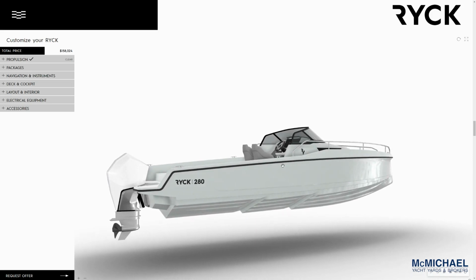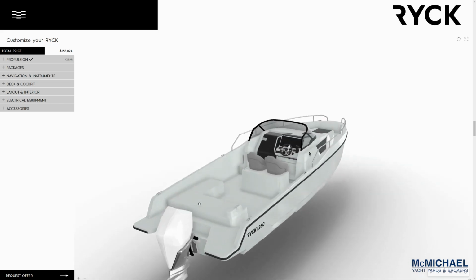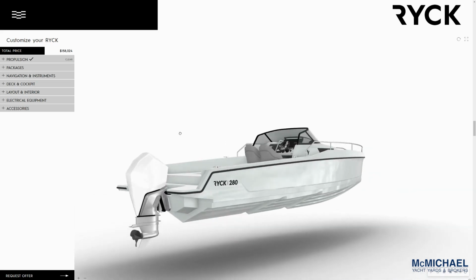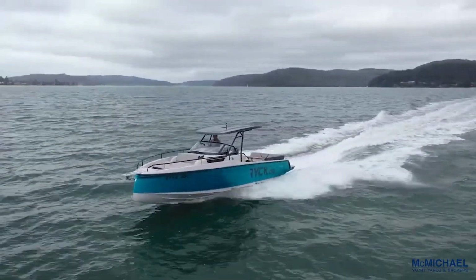Now, if we take all those elements, good high freeboard, the deep V entry here at the bow, the double chines, the strakes that we have, the stepped hull, the engine box, and the cut at the transom. Notice that the gearbox, which is this bullet point down here on the engine. So this pad that comes out here is the anti-cavitation plate. And then the bullet here, this is below the keel. Now, what that is doing is, number one, they're getting rid of drag back here, but they're getting clean water to come directly into the propellers. So a lot of thought has gone into this particular design on the 280. And it's one of the reasons that in our experience, not just with our boaters, but ourselves driving this boat, you get such a good ride.